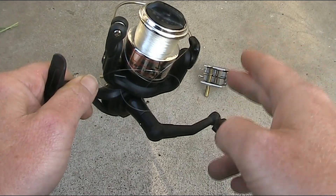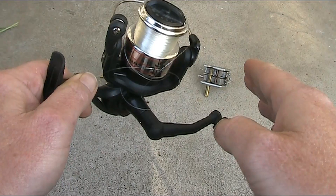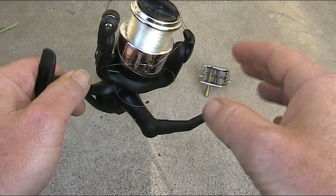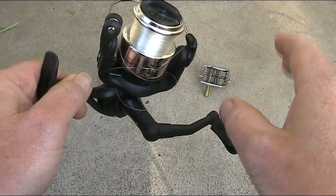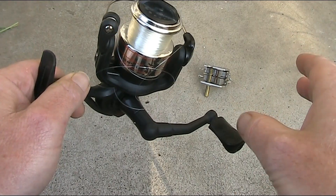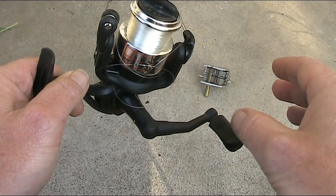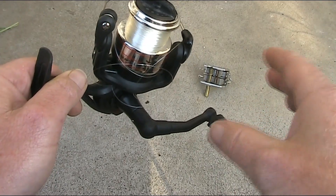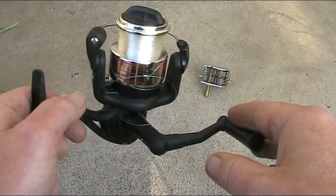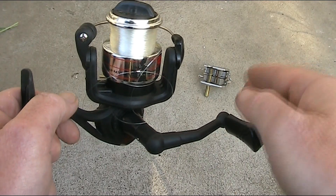This makes tuning much, much easier. That's really important if you're building radios with these types of variable capacitors, because just having a knob directly on the capacitor means you've only got half a turn, and tuning can be quite difficult — especially if you're trying to tune a wide frequency range or receive SSB stations. Mechanical reduction is really important to having a usable radio.